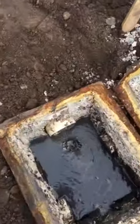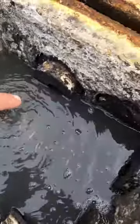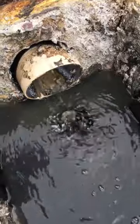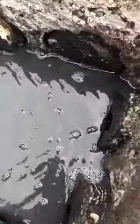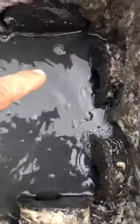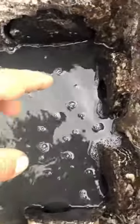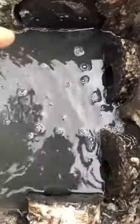Now that we've completely unblocked all the channels, we adjusted our speed levelers and had a good substantial flow coming from the house so we could direct it as needed. This area here was receiving the most and was getting short-circuited, so now we have it directed to receive the least amount of effluent to help in its recovery.